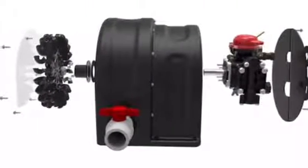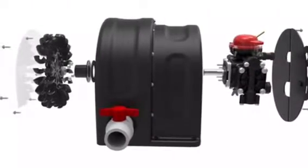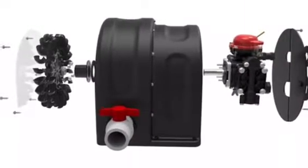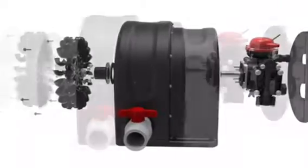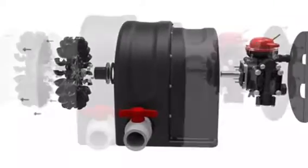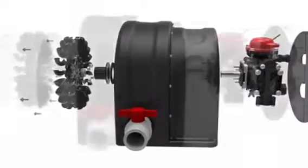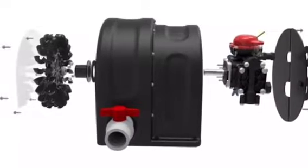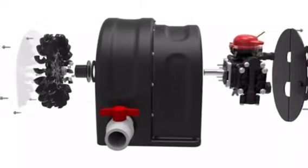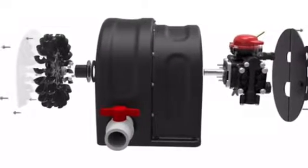This is a picture of the pump in an exploded view. As you can tell, on the left-hand side is the Pelton wheel that is driven by the 2 jets, pictured in that white little valve on the left-hand side. That's one of the jets. It drives a variable stroke pump on the right-hand side. This is where it can use 2 different water sources. It doesn't mix the clean water with the dirty water. It uses the stream to power it. The pump on the right-hand side will take water from that concrete cistern and pump it up the side of the mountain, approximately 80 feet. As we said, it'll give somewhere between 35 and 40 pound of pressure, depending on where the houses are located.